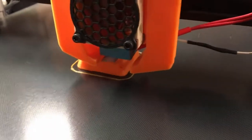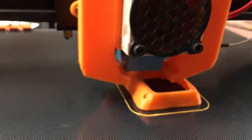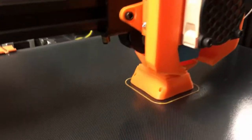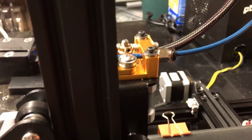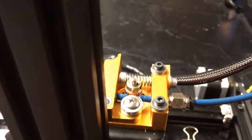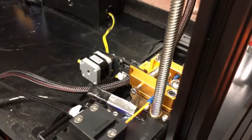This is a pretty solid piece, so nothing flat to pop up. Anyone that's printed ABS knows that thinner flat pieces will pop up quite easily — this is holding nicely. We're back for a quick update and the model is looking great — nothing coming off the build plate, no extruder clicking whatsoever. You just hear the grinding of the filament going in. I might have to loosen the extruder a little. It's a McWen 3D design, also made for flexible filament with two pieces of Capricorn PTFE tubing guiding it through.